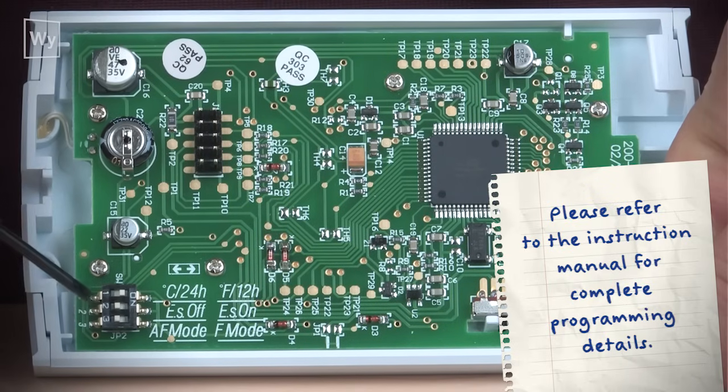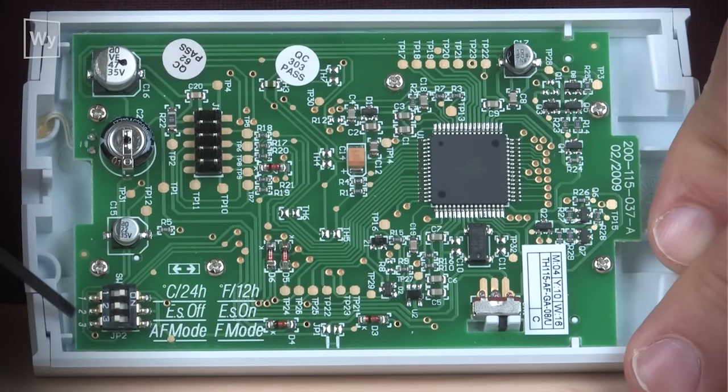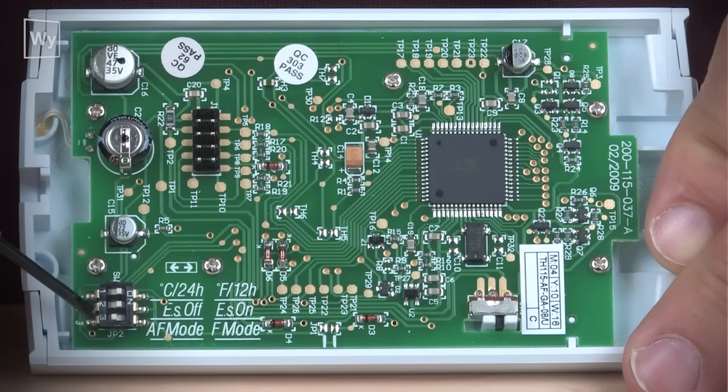That is early start. If you turn early start off and program it for 7 a.m., that's when the temperature will begin to warm up, and it won't reach the actual temperature that you've asked for. That won't hit until a little bit later. So we suggest if you set the program time for 7 a.m., you want the early start on so it is warm at 7 a.m. You don't have to try to figure out how long it takes to warm up.